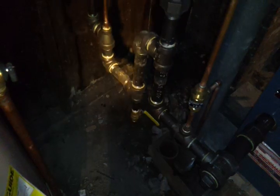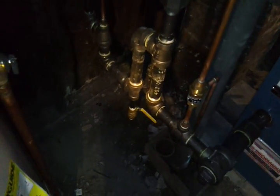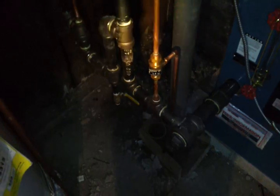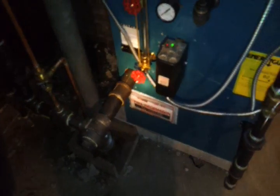So that's it — this is our steam header and our condensate return. I always put a drain on these. They get filthy over time and sometimes need prodding with a coat hanger to clear any clogs. So I always leave a connection there. Some boiler installations we even put a strainer in them, but typically not in a single residential application.